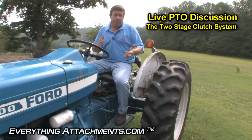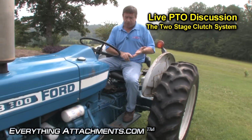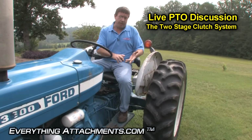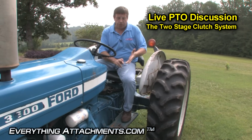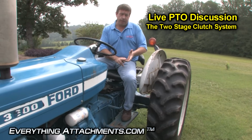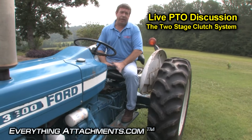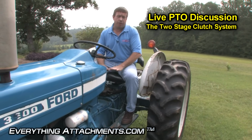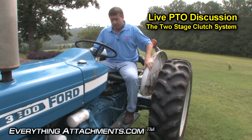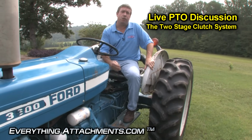There's 3 main kinds of PTO, and there's a lot of different variations. You have manual PTO, which means it's going to stop when you push your clutch in to stop your tractor. You have live PTO that's done with a 2-stage clutch, which is what this is, and I'm going to explain that. And then you have independent PTO, which is simply with a lever or a button on or off anytime, whether the tractor's in gear or not, unrelated to the clutch. It is a form of live PTO, and it's on or off anytime you want it. That's why it's independent, because it's independent of the clutch.